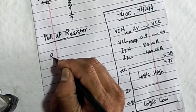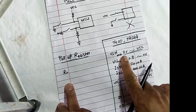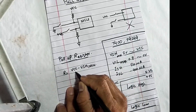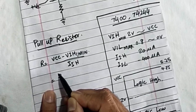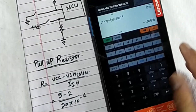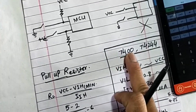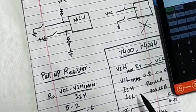To calculate the pull-up resistor value, R = V / I. At this pin, the minimum logic high level is 2 volts and maximum is VCC 5 volts. So R = (VCC − VIH minimum) / IIH = (5 V − 2 V) / 20 µA = 150 kΩ. This IIH current value of 20 µA is from the 7400 datasheet. For any IC, check the datasheet for IIH.